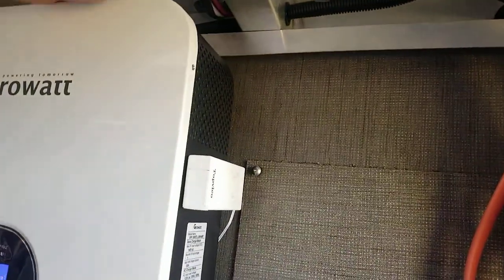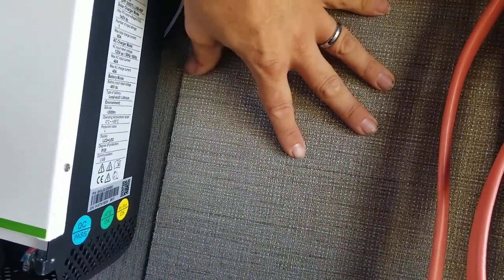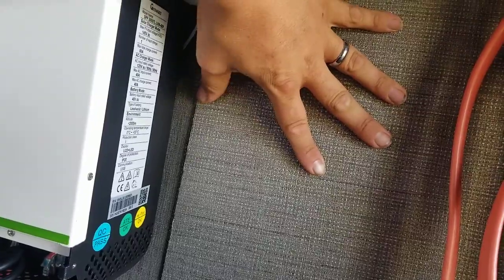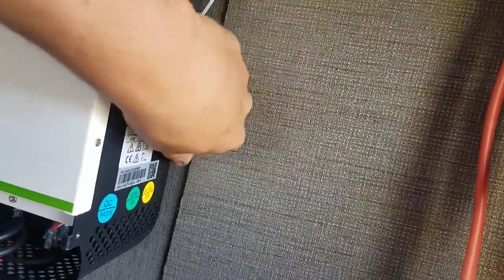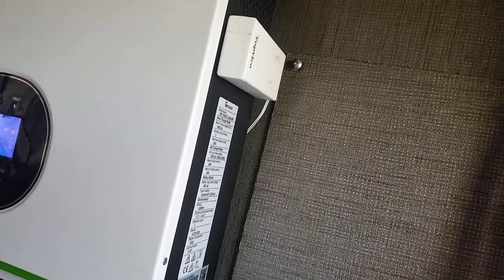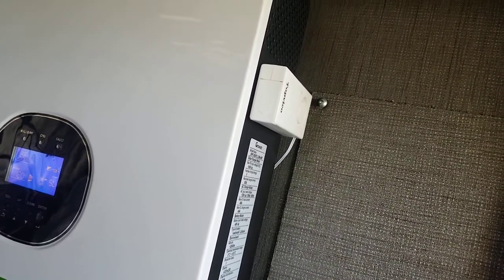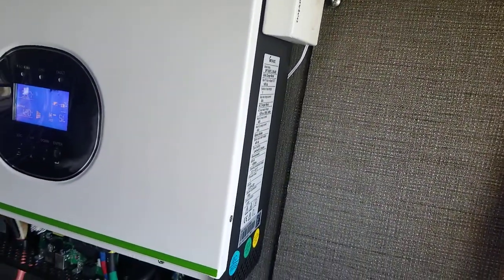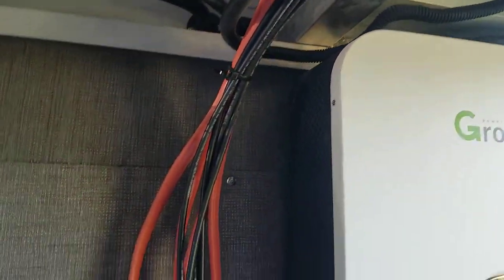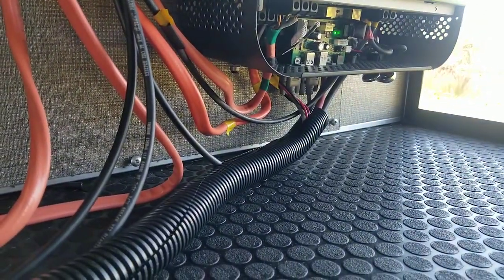Here's a mounting option. These are mounted on aluminum with a space behind this, and this is a high temperature resistant artificial surface, so this is completely fine to be warm. If this was something like automotive carpet or some other type of flammable surface, or a surface that would catch fire if you were to spark it, then I typically would go with a sheet of plexiglass, as it is both non-conductive, relatively inexpensive, and being clear, it doesn't make you have to deviate from the current artistic style of it. Can't think of anything else to explain.